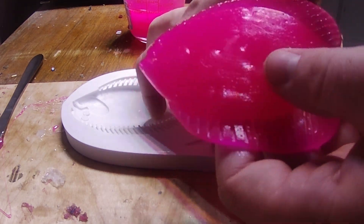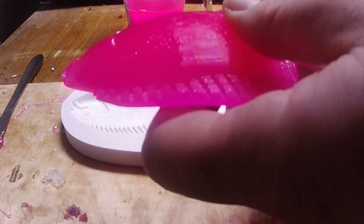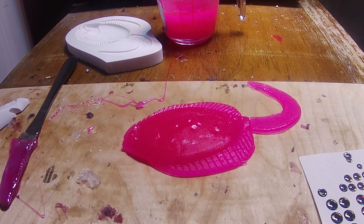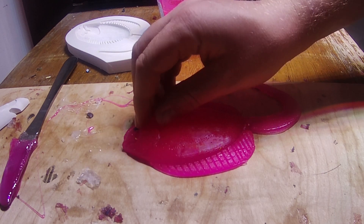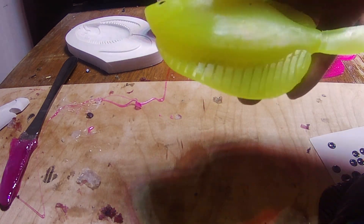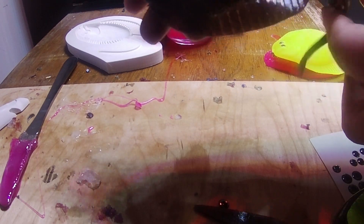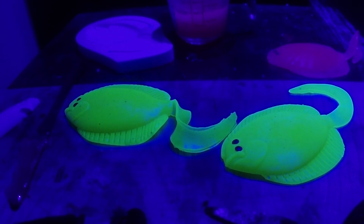It's a little dented because I was very cheap on the infill and only put 15% — you guys should use 35% infill on this. The mold box is made out of PETG, that's what I recommend using, unless you're going to use resin, then that would be Siraya Tech Sculpt. I'm just going to peel off this flashing. The adhesive on the stick-on eyes I bought isn't really strong enough, so super glue will make sure it's on there forever. And there we go — we got some eyes. So that's our pink lure, here we have a nice chartreuse color, and my original attempt at the brown natural-looking color. One side note — the chartreuse glows up quite well under UV light. I guess that's pretty cool — nice glow-in-whatever-light lures.